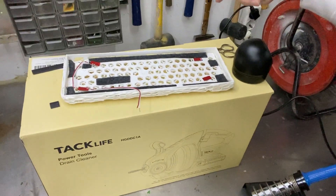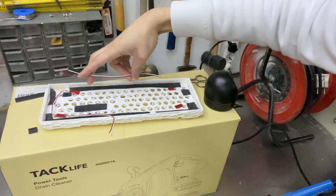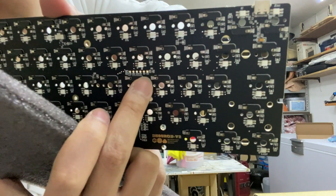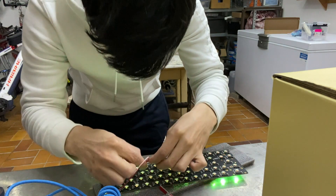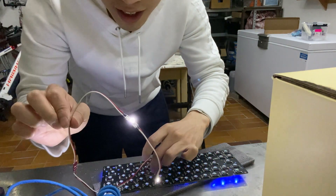With this little LED that we cut off from the LED stripe, we distribute them — as you can see, we got four. We cut little cables with the corresponding length and we solder everything. This is the DX60 — you see somewhere it says ground and VCC. Beautiful: red is the VCC and white is the ground. It works!